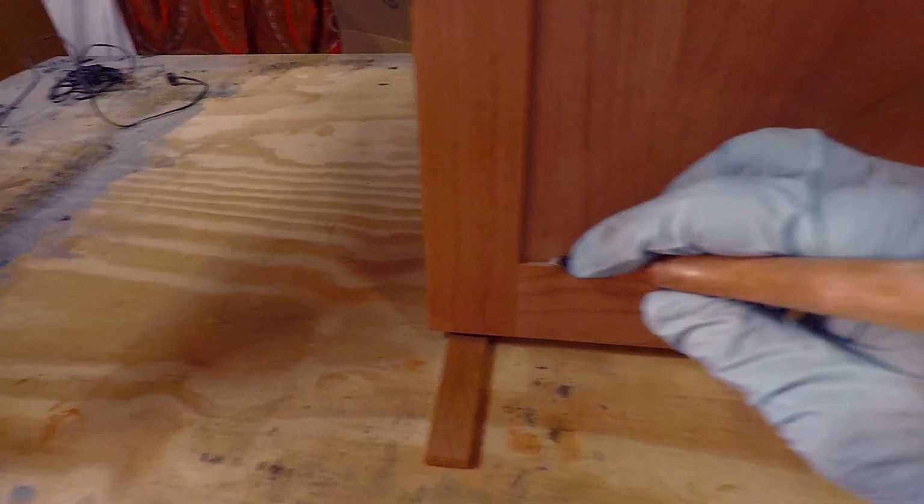While spraying the lacquer, I will sometimes get thicker areas in the bottom interior of the doors, just like with the shellac. I'll carefully touch it up with a brush, and I found that if I do it early enough, it won't leave any brush marks.